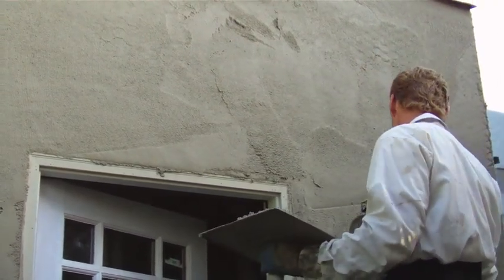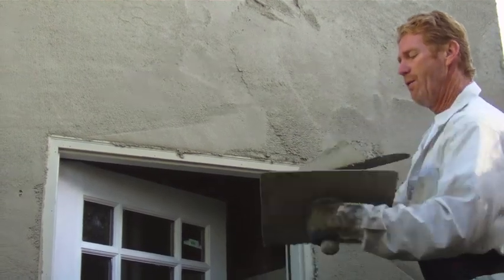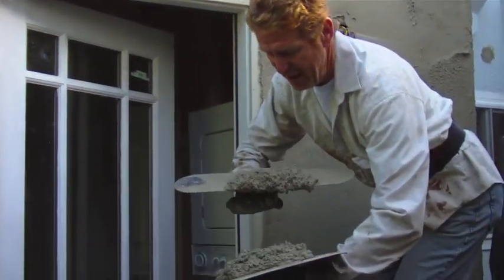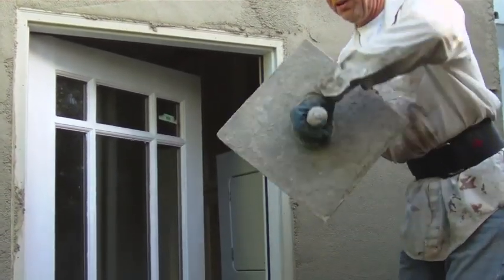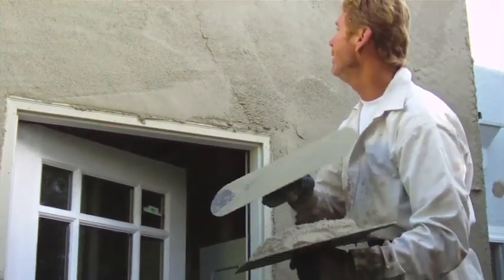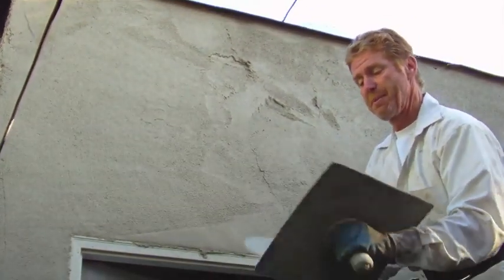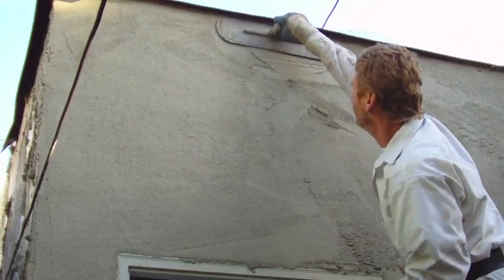I don't drop a lot of mud like some folks. When I put it on here, I put it in the middle — I leave two to three inches on each side. When I do the tops, I pull it off the top, squish it up there, and take it off.